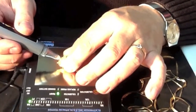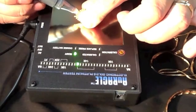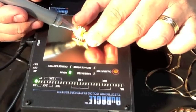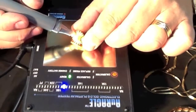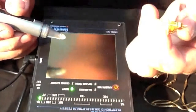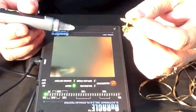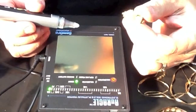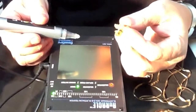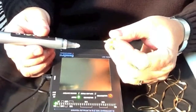We're just going to simply touch it with the tip and watch it climb and see what it becomes. We can see it's almost 18 carat — these earrings are higher than 14 carat. It's stopping at around almost 17 carat. So this is how you would buy this: you would need to check the price of gold that day — I would check kitco.com, it gives real-time prices of gold — and make your customer a cash offer. These earrings appear to be 17 carats.